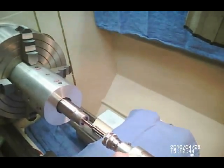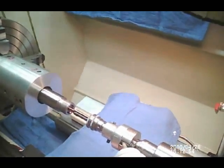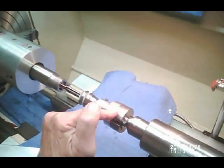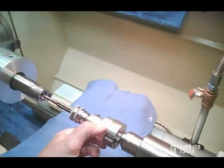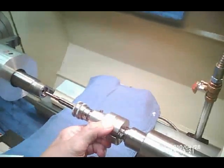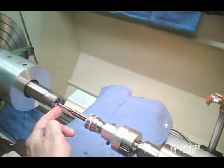Move your bushing into the hole and guide it in. Once it's guided in place, put a little bit of Viper's Venom on the Manson floating reamer holder. A floating reamer holder will only float if it has a barrier of oil between the two metal surfaces. This particular head floats in all directions — the reason you want it to float is so that the pilot, once it's in the bore, will guide the reamer in and the holder will adjust accordingly.